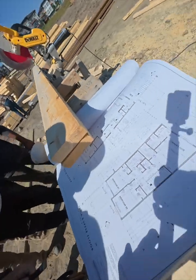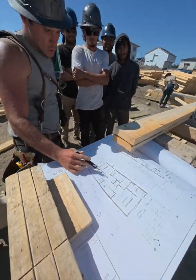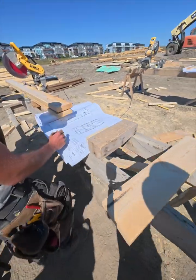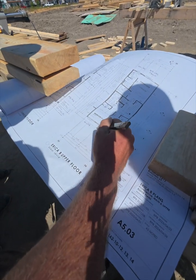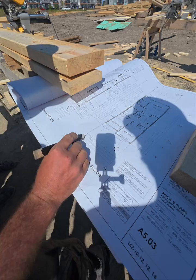The first thing you wanna do when you're laying out a wall is get the plate measurement. So if you look to the front, you'll have all the measurements right here for the whole house, the side, the front. So if you just take the edge here, follow it up to right there, and then this to here, you can see it's 8'9" 1/8. So we'll write that down.